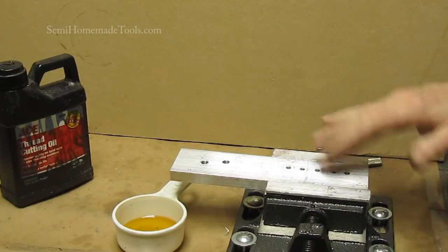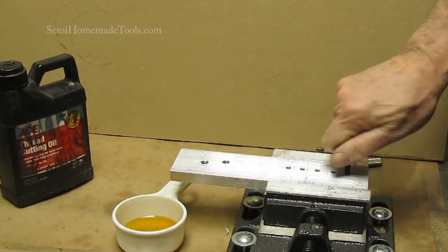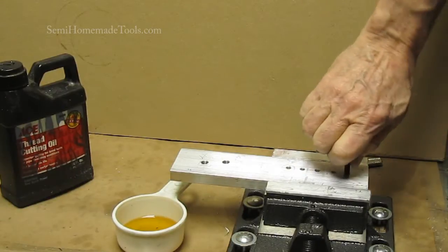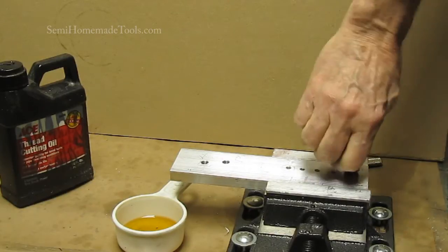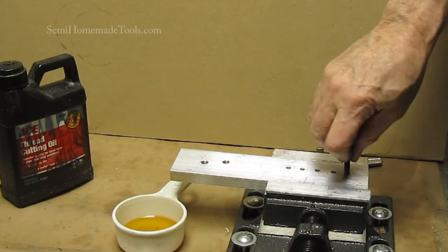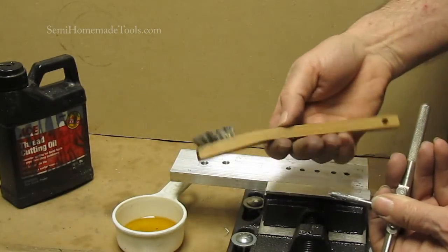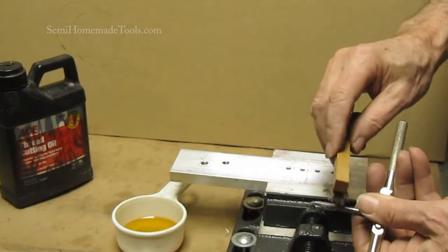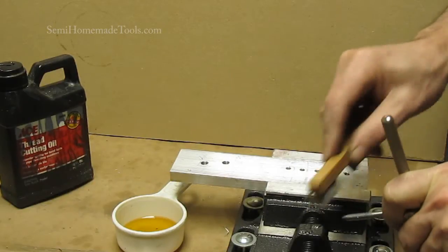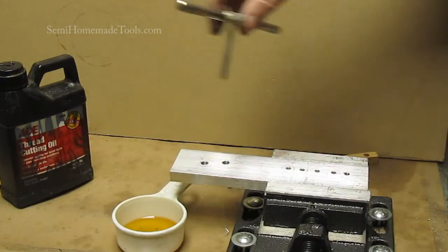And there we go. I always try to make sure we've got it right — and that's our test screw. It just goes in there very nicely. You can do it by hand; it's a little bit tight, but that's good — we want that to be tight. Then after every hole, you want to take a little wire brush — this is just a brass wire brush — and clean out all the threads before you start a second hole. Otherwise you will end up binding right away. Much better to clean it really well before you start the next hole.